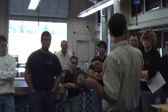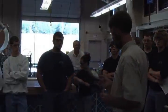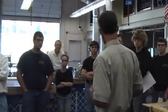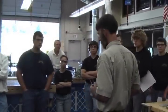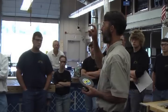And if you're responsible for grinders, and you've got a cracked stone, next thing you do is take it and smack it against some metal and break it in half. That way nobody's going to use it and get hurt with it. I cut the handle off a hammer the other day because it was cracked. Can't make a mistake when the handle's only that long.